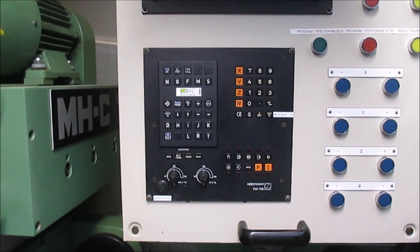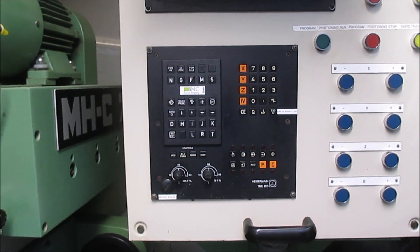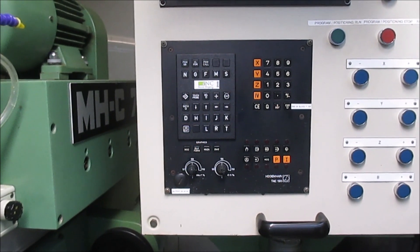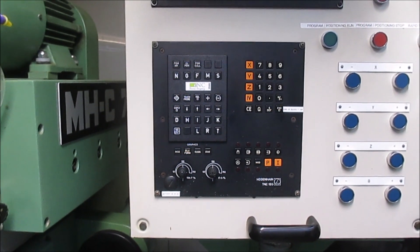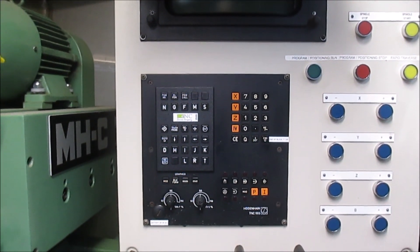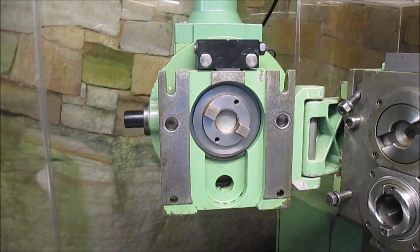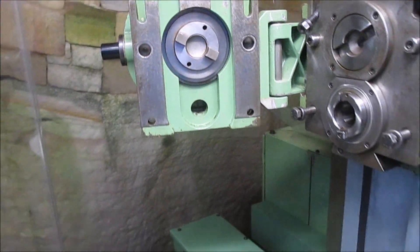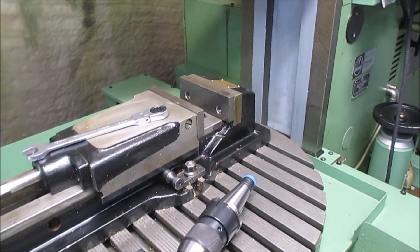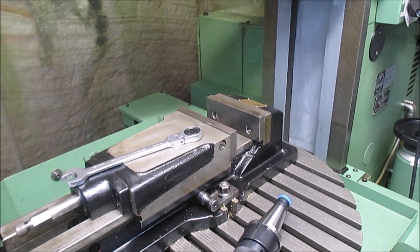This machine has got the last possible firmware and software updates, with the final software upgrade around 1991 before they changed the model to a later one. This is one of the first controllers capable of doing five axes — I've only got four, but you can put a servo on the vertical head and use that as a fifth axis, instead of lifting the whole knee and rotary table up and down, which has a mass of about 600 kilos. So if you're peck drilling with a very small drill you're lifting 600 kilos up and down — not exactly fast.